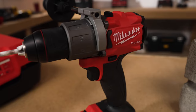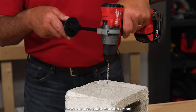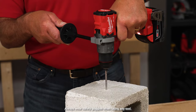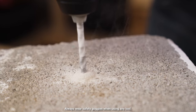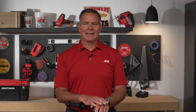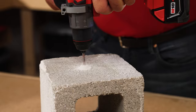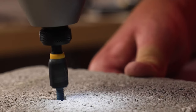It is a drill with a keyless chuck that allows you to adjust the strength of the clutch depending on what you're drilling in. But when you turn the chuck to the hammer mode, it not only drills but provides a hammering motion to the backside of the masonry bit installed into the drill. So if you're going to be drilling into concrete or masonry, you will be drilling and hammering at the same time. With the right bit, you can do this quickly and efficiently and get really precision holes to allow you to use things like tap cons or lags and shields — whatever you're going to be anchoring into the substrate, a hammer drill will do the job.